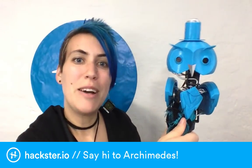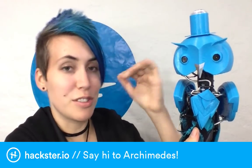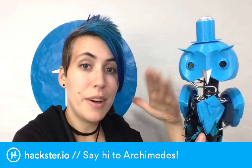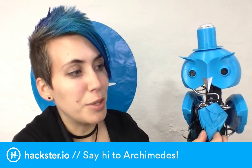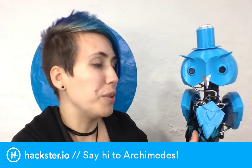So he's mounted on a servo pan tilt gimbal, which basically means there's a servo on the top that goes like this, and a servo on the bottom that goes like this. And so his whole body tilts forward and back, and then his head, you'll see it go side to side. And basically I had to just calibrate those servos so that they would work within the proper ranges.